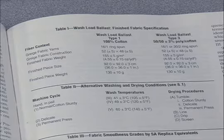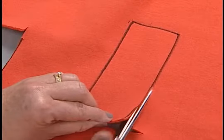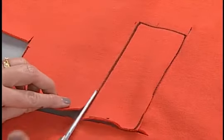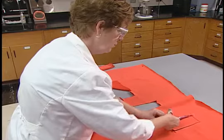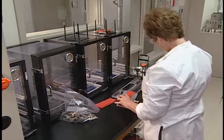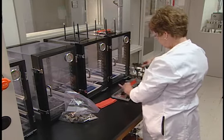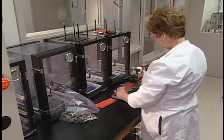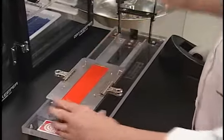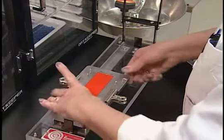For actual flammability testing, five 50 by 150 mm specimens are marked and cut out of the fabric sample, with the long dimension along the fastest burning fabric direction based on the preliminary testing. Additional specimens may be needed to verify the flame impingement location. Raised surface fabrics are inserted into the specimen holder with the side that burned the fastest in the preliminary test uppermost, and with the lay of the surface fibers away from the closed end of the specimen holder. The specimens are brushed from the open end of the specimen holder toward the closed end in order to raise the surface fibers to their highest level.